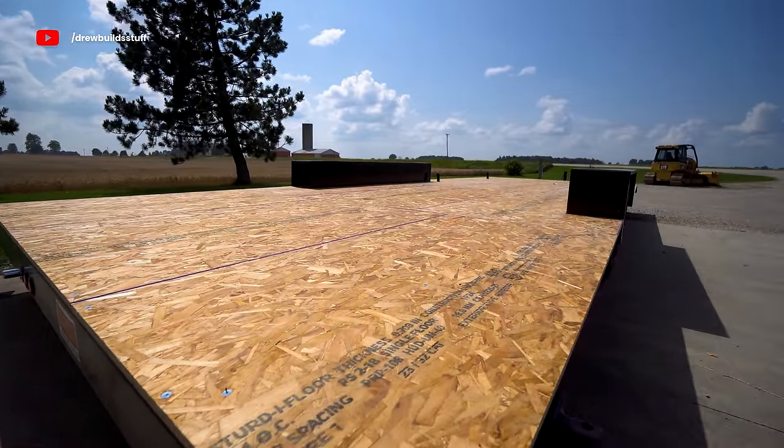So to mount these beams into the tops of the walls, I'm pre-drilling in another quarter inch hole, and then using some of these 9-inch long, 3/8-inch lag bolts. Holy f***, that was close. Oh my god. My camera and tripod almost blew off scaffolding probably a dozen times in this build, but that was definitely the closest.